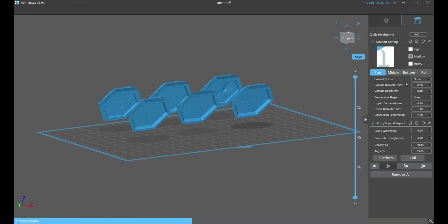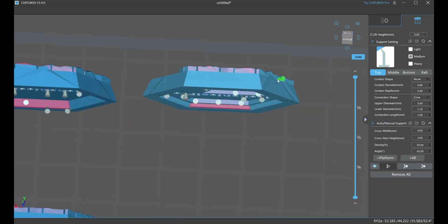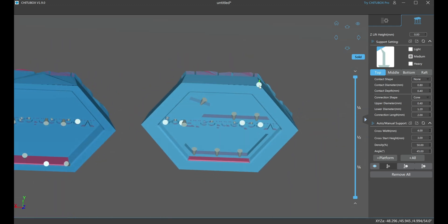I tend to print them at a very steep angle. This buys some space on the print plate and has proved to limit the number of failures I've experienced at lower angles. The auto supports are also almost always lacking, so I go in and make sure that the parts of the model that are built first have some extra supports, as well as any bits that overhang as represented by the darker reds in the support section of the slicer.